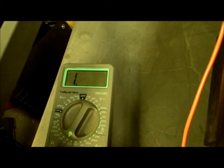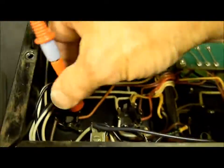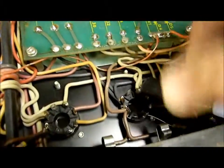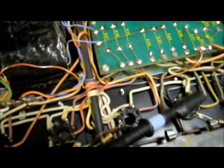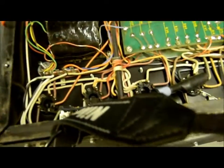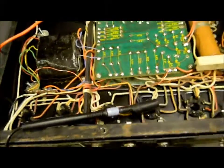One way of troubleshooting. I've already checked the cathodes — they're all connected together properly and grounded. That may be its only problem. I'll have to pull this board out and probably change all six resistors; resistors are cheap. On the other side, pin three to pin three gives us 12 ohms — about six ohms in each resistor. These three are working, but this one in particular has quit. This is something you can determine using just an ohmmeter — but always make sure the amp is unplugged and the capacitors are discharged, or you could be in for a very bad experience.